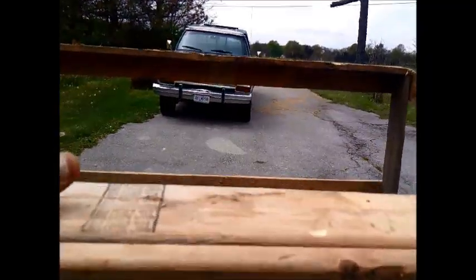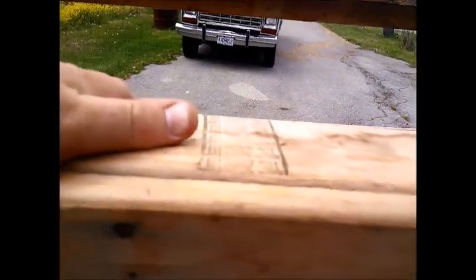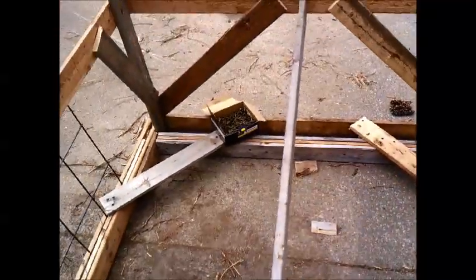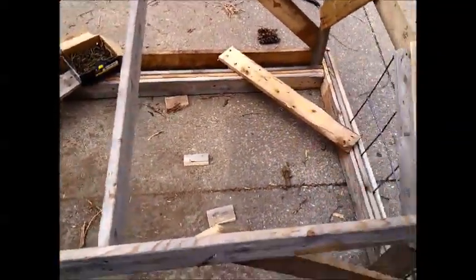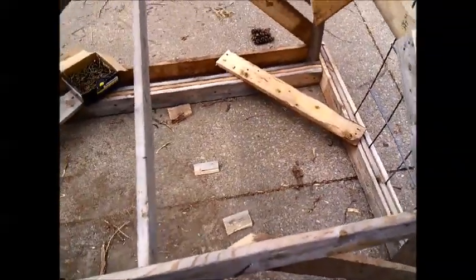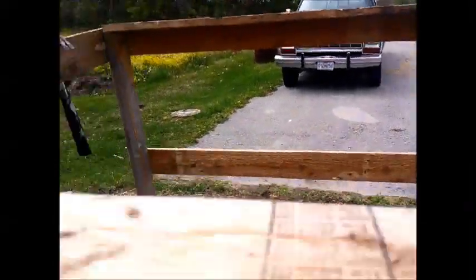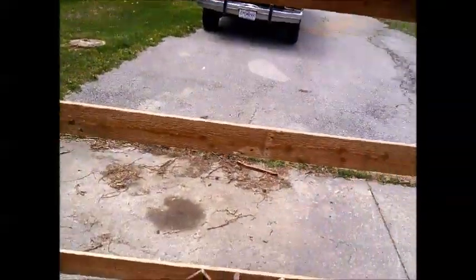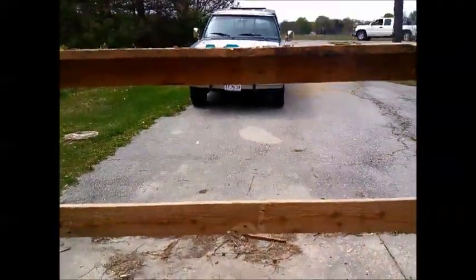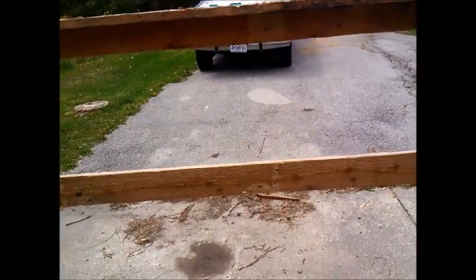So the tin roof will sit up here. Down here I will use a wire, like a chicken wire, on the floor. That way they can poop in the chicken house and the poop will go right down on the ground. We won't have to clean it out. All we'll have to clean out are the nesting boxes, which will make it nice. We'll build a little ramp from this board up to the bottom of the coop, and we'll put our nesting boxes up kind of high. You can see the extra framework there, running right across there. That is the framework for the nesting boxes.